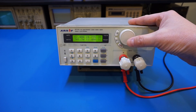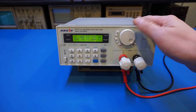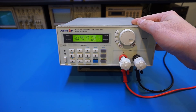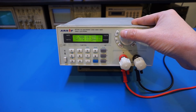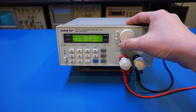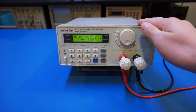It hasn't cut off yet. I believe this unit has some built-in margin and you can actually go slightly above the rated wattage. Right now we're sitting at 301 watts and everything is behaving well. Continuing: 303, 306, 308, 309 watts. Roughly at 310 watts the unit cut off the output to protect itself from being overloaded.